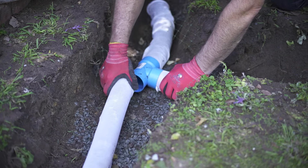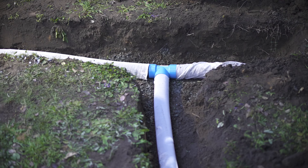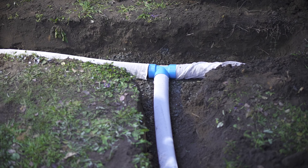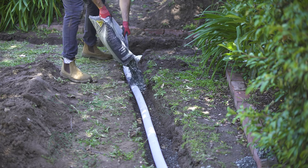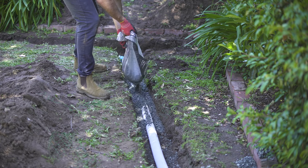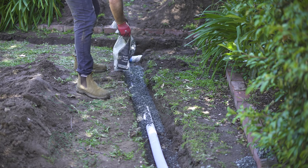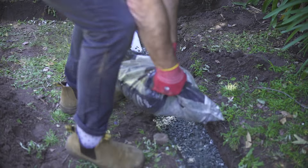Block any open-ended water flow with end caps if required — otherwise water flowing out of these areas could cause pooling. Once your pipe is in place, add in embedment fill to cover the top of the pipe with the same material used in your base layer. Make sure the drainage metal is worked around the sides of the pipe for support. A 50-150mm layer over the pipe is recommended.